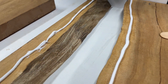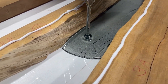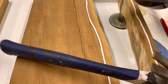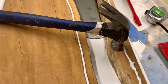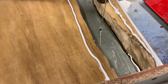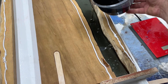For these four chopping boards, two of them I wanted to have bullet casings in the resin, so for those two I poured shallow passes to let it dry and then cast the bullet casings afterwards. The other two I poured a complete fill with WoodCast 30. The nice thing about WoodCast 30 is that you can pour up to three centimeters and it works perfectly.